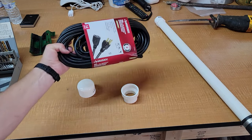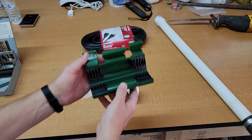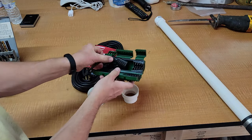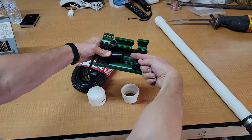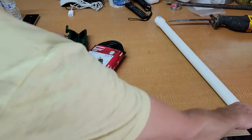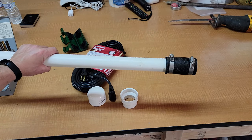One thing I didn't mention was the extension cord. I would recommend a 12-gauge cord, depending on how far you're going to run it. Here is the extension cord cover — this is going to be used in conjunction with your extension cord and your sump pump wire. Sump pump wires are only about six feet long on average. You stick them inside, plug them together, and snap it closed. I've not had any issues; every time I open it up, it's nice and dry.